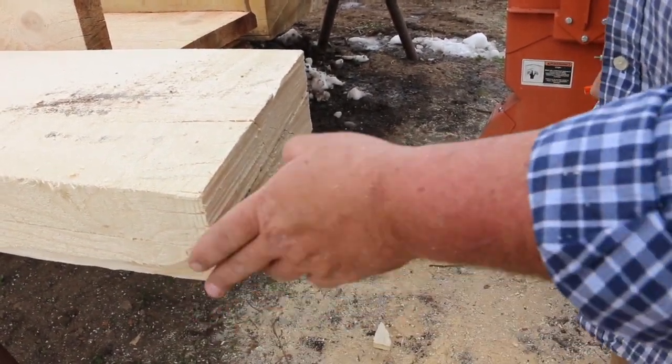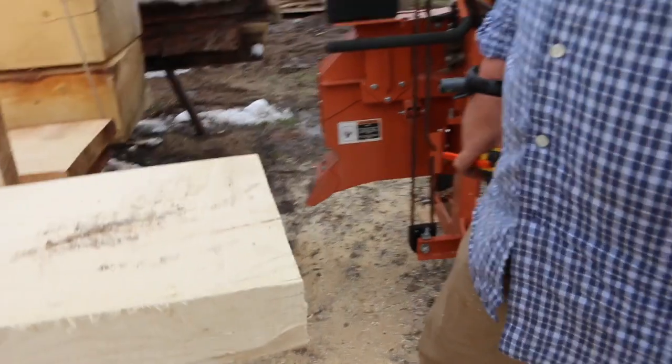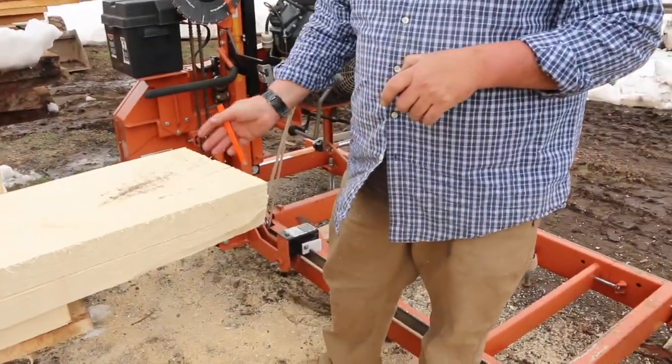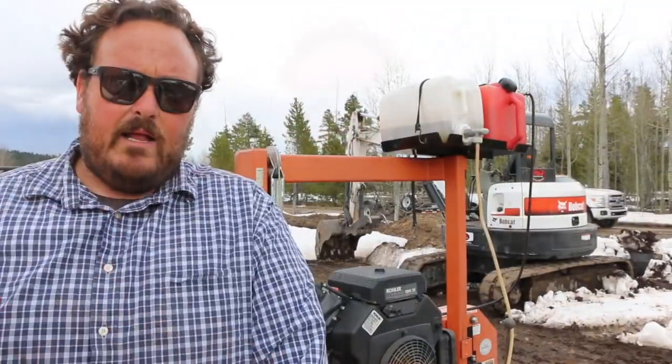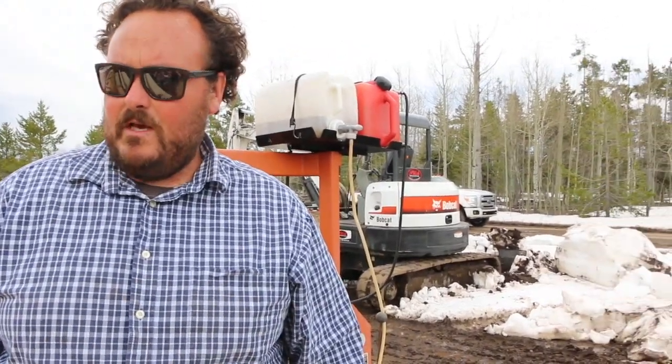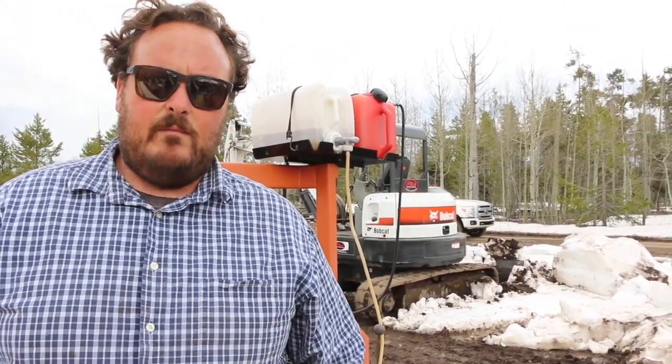I mean, I could do a lot better with a skill saw or a beam saw. But we're not building a piano. You're gonna hear me say that quite a bit. Time is of the essence, so that'll be our angle and we'll follow that up. 7 by 11 is kind of a normal stair tread. And so if we stick to that, it should feel normal. It should be ergonomic, it should be comfortable.